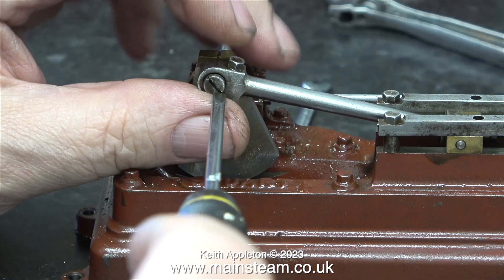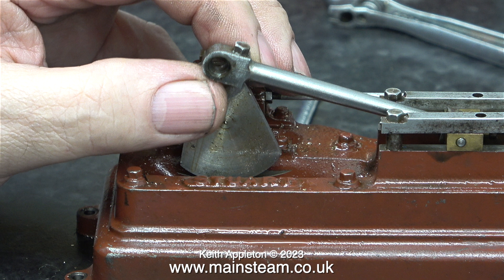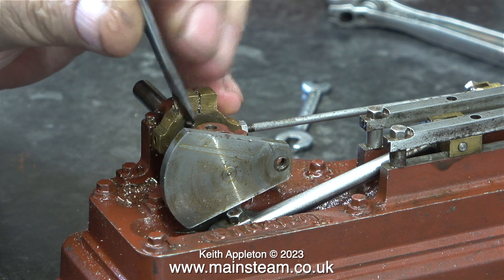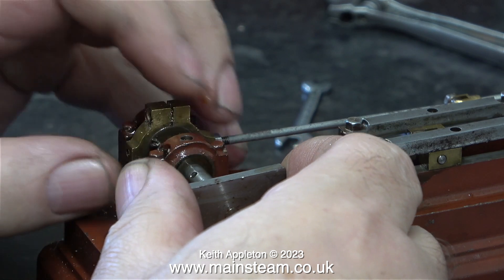A quick word about the direction of rotation of the flywheels on horizontal engines — they normally revolve away from the cylinder. But on Stuart S50 steam engines, I really don't think this is the case, for a couple of reasons, particularly on the older models. On the earlier S50 models, the end of the crankshaft where it fits into the crank web was threaded using a left-hand thread, and the crank pin has a normal right-hand thread. Which means that if you set the direction of rotation of the flywheel away from the cylinder, not only will the crankshaft probably unscrew from the crank web, the crank pin will also try and unscrew. I may be wrong about this, but I have actually managed to unscrew a few crank webs in my time. The Stuart S50 is the only model where I've come across this.